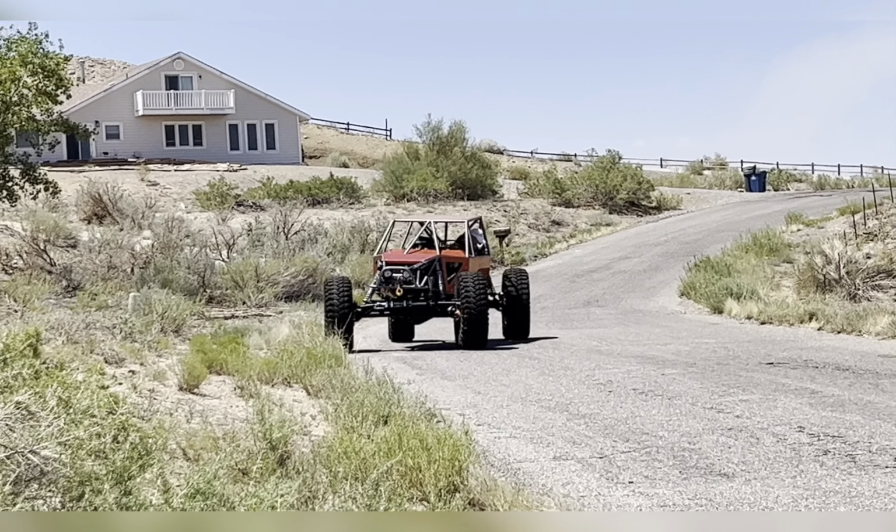Well, that's gonna do it for my first rear steer installation attempt. It actually came out pretty good. There's a lot of different things you can do on these rear steers. You can put self-centering units in so that the rear recenters itself. You can use electronic joysticks instead of the manual like I used in this one. There's goods and bads on all of those.